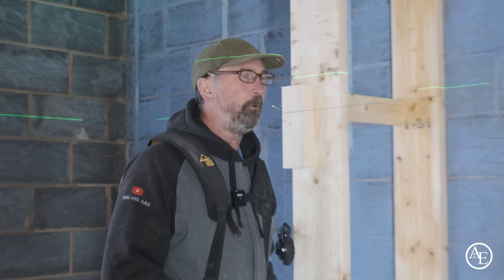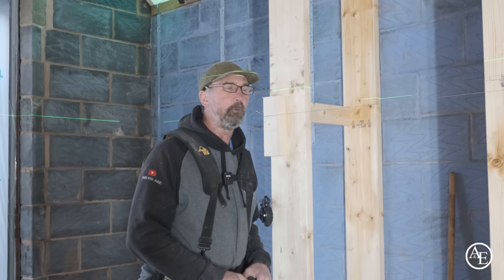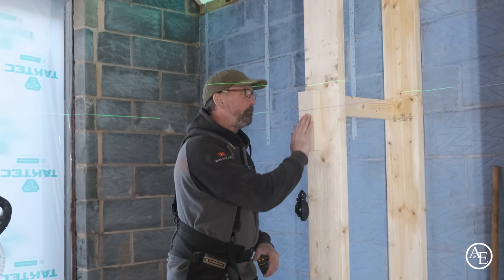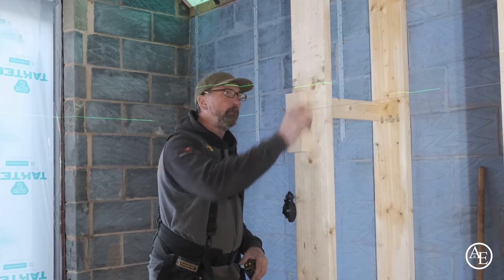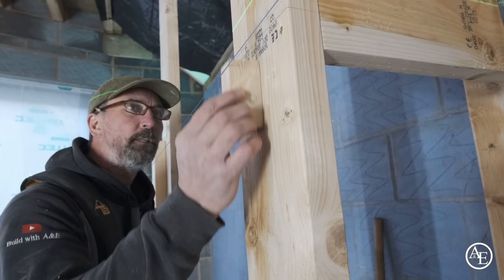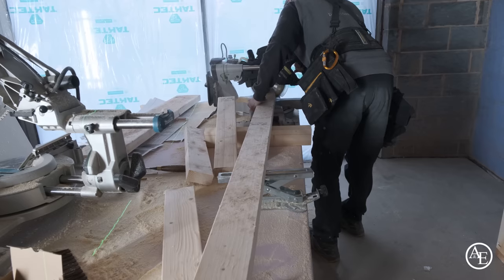I like them to a point, and they are good, but I do go back to the old school. Get a piece of timber on here, line across it, then check it with the timbers, and then I know it's really, really true, so just the way I roll, sorry. So I've got timber coming across here, guys, so it's just a little bit of a check. Look at that, just beautiful, just touching the back of that line, that's how we want it.